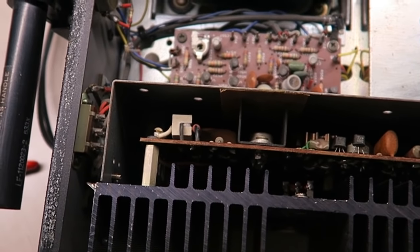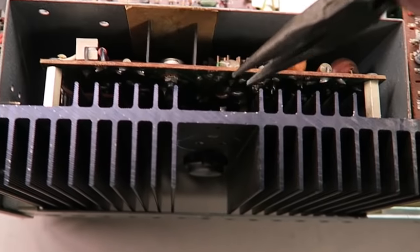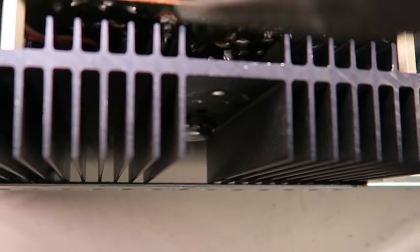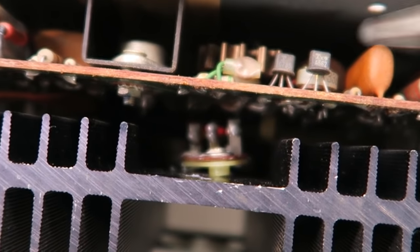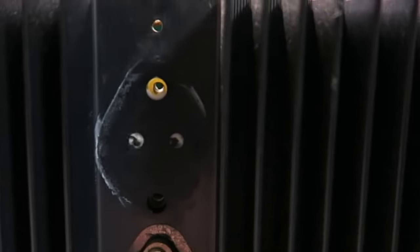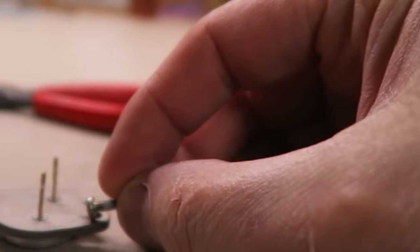You can see the socket down in here — little plastic pieces that pop up into the holes. The plastic is visible from the other side, and the screw goes through it to keep the screw from touching the metal and ultimately shorting to the heat sink.